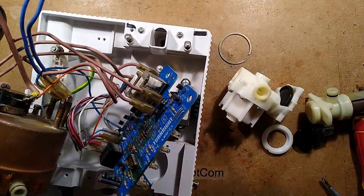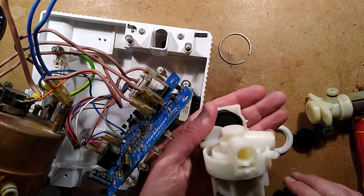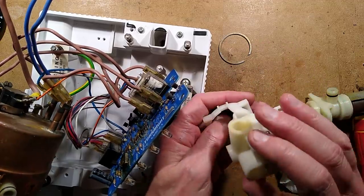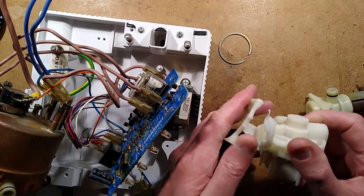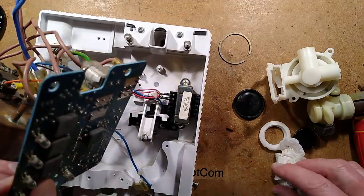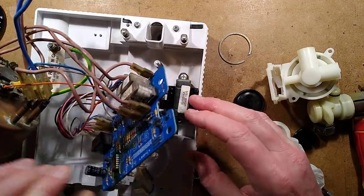That's a bit terminal for this heater unit. This is not easily serviceable — I don't know if spares are available because it's pretty old. But having said that, if it's got to the age that the plastic has degraded and that just pushed it over the edge, that's a slight water hammer, and it really has cracked. I think it's time to replace this shower — I'll get a new shower. That's probably the best bet.